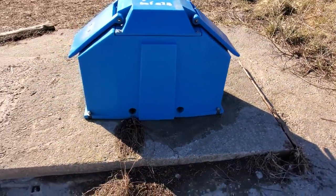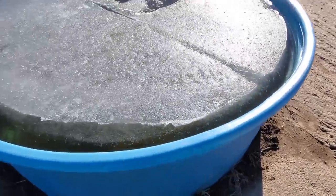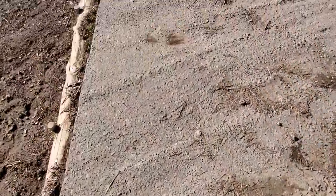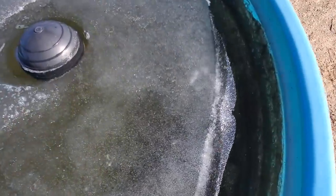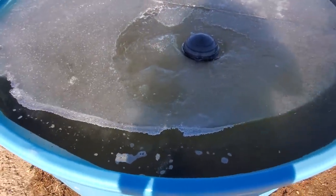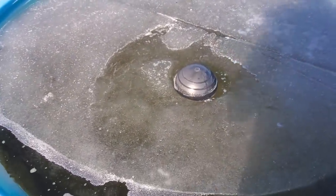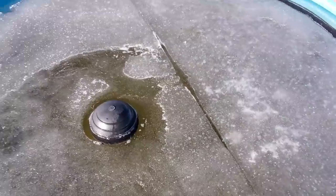That's a lot of money — this is three yards of concrete right here, and I could have had my tank in the middle of the concrete instead of over here on the edge. The cows can still drink okay; they've got room to stand. We'll come in in the morning, take an axe and cut that big ice cube off — it's probably about four inches thick. If we'd drained the tank and turned it back on tomorrow, that pipe would have been frozen all the way down and we wouldn't be able to use it the rest of the winter. So we let it freeze up and when we come to that tank we just cut that ice cube off.